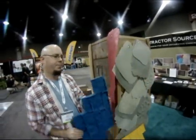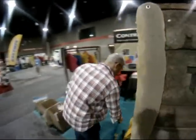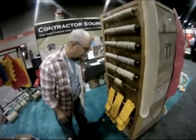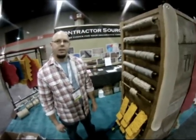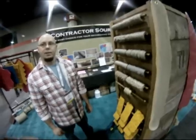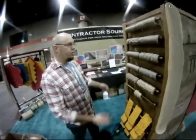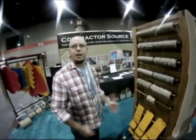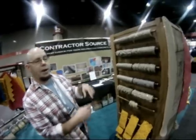Because the textures you're using for these are very similar to the rollers and stamps you already have for vertical work, you can easily take a stamp, cut out a little bit of square footage, and then freehand something to complement it or really break up the wall so people wouldn't know there was a stamp at all. Do a section like that, do long pillar rocks that look like they're encased within there, and continue on.